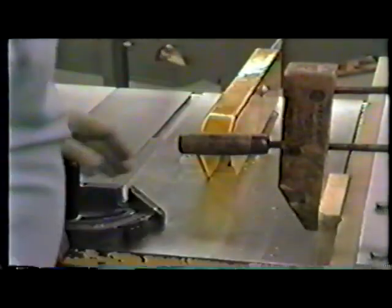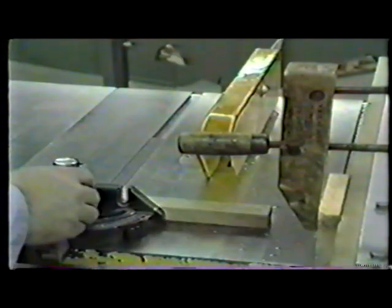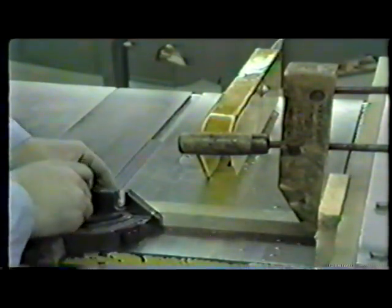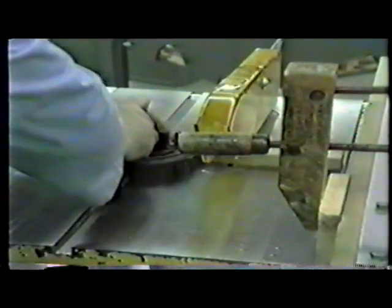first of all, we take and find a clamp that's going to fit, so I'll be right back. A clamp, I think, is going to work this time. We take and clamp this wood down and clamp it securely to the fence. Now, what that does is if we wanted to cut pieces of wood the same length in here, I can use my miter gauge and I run it up against this stock here. Run it up against the stock and then I can cut it.